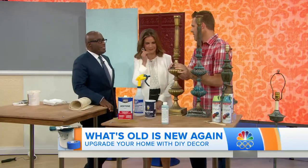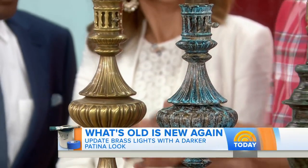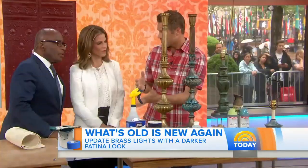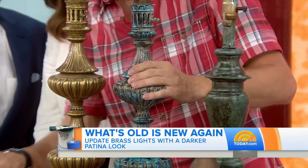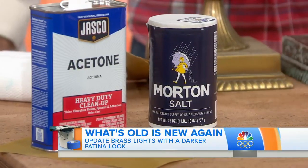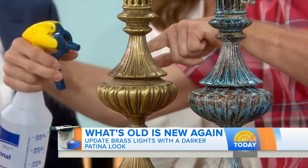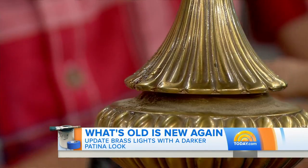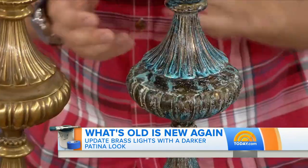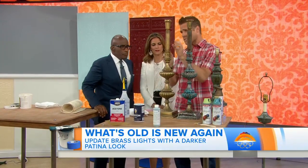There are some lamps that are less than ideal in your motif. While this is a pretty lamp, what I like to do is add character to them. This is a brass lamp. All I did was take things from around the house and add it to my old brass lamp to give it character. I used a little salt, a little vinegar, and squirt it on — put it into a spray bottle. You can see the liquid on there right now. It creates a reaction with the brass, and therefore you get all of these different color variations. You create that instantaneous aged technique. You do have to sand it down just a little bit and use a little acetone to etch it first. But once you do that, you can get that look — and here's what it looks like afterwards.